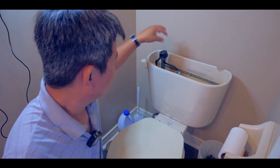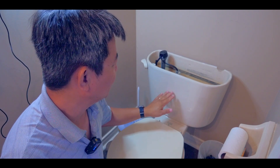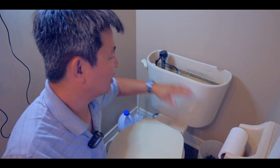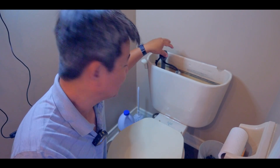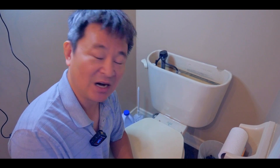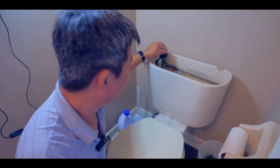As you can see here, the problem is the fill valve is not working properly. I noticed when I turn on my water hose, the toilet reservoir that contains the water goes all the way up and it doesn't stop. This fill valve was supposed to be triggered so that once it reached a certain level of water, it should have stopped, but it didn't. So I suspect the fill valve is the problem and I'm going to try to take it apart and see if something is not working properly. Maybe I don't need to replace it, but most likely I'll buy a new one if I can't fix it myself.